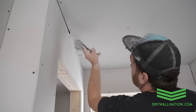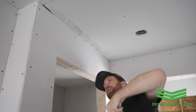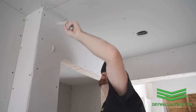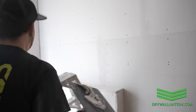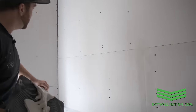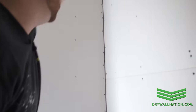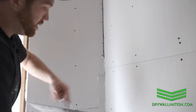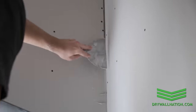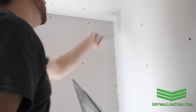You can see I'm not only pre-filling butt joints but any gaps there may be. The sheet was a little crooked — we're about a quarter inch here and it opens up at the top. Pre-fill any type of gaps like that so that after you tape it there's no chance of your mud shrinking back and getting bubbles in your tape.